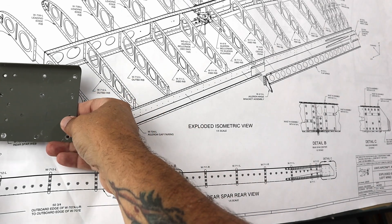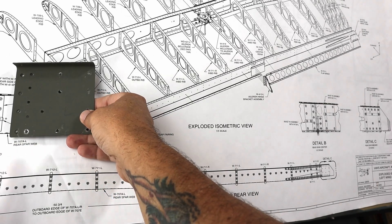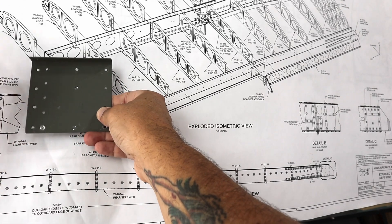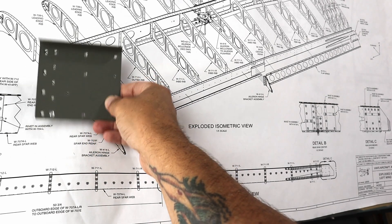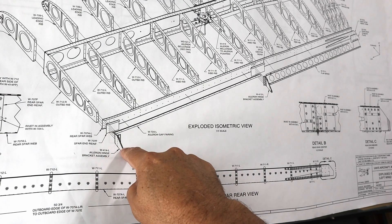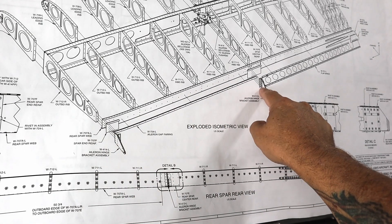When I was riveting it on, for some reason I thought, oh yeah, there's that one random flush rivet. So I put the countersink — don't ask me why — I put the countersink on the doubler. You can see, because it's clear and shiny, that I did this after I had primed and everything was ready to go. I was like, oh my gosh, I almost forgot this one stupid countersink. So I countersunk it, riveted it to the spar, and then I looked back at the plan and realized what a stupid thing I had done.